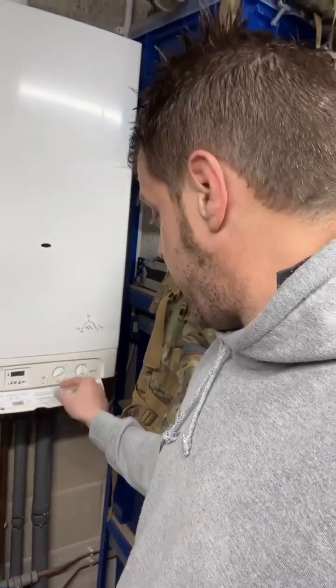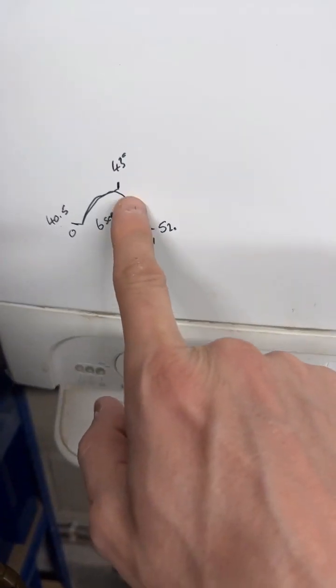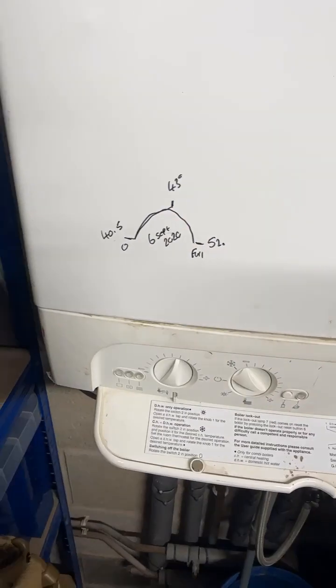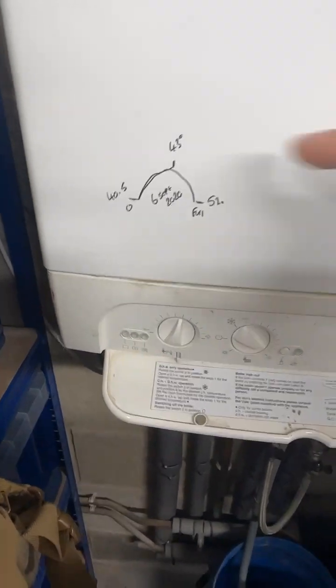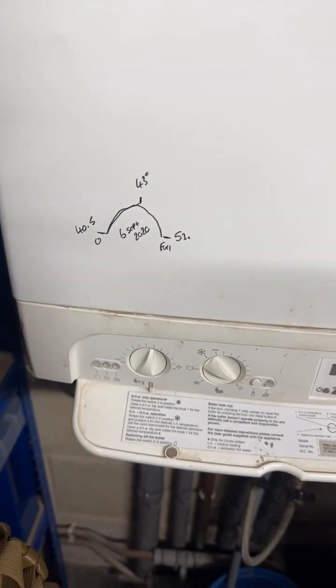Back to general electrical content. The boiler's been on because it's been cold and raining today, so I've got a little bit of data. I'm going to use that data to adjust the flow temperature, which at the minute is basically turned up as hard as it'll go. I've already done a few calculations — my hot water is around 43°C, which is about the temperature I have in the shower, so that's set to that.